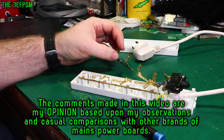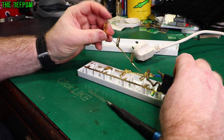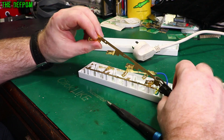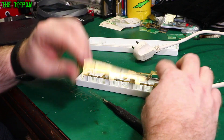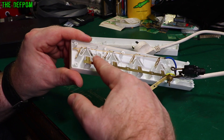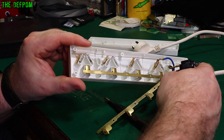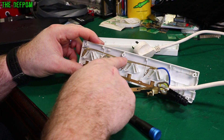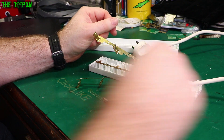If you had a nice positive connection like you do on the earth — the earth is really good — if they did that same connection for all of these it would have been absolutely fine. It's not a great design. Now, if you look at this one here — can you see these black dots? There. And there. And there. These have all been arcing. All of those connections have been arcing. There's another one there as well, on that side. Yes — these have been arcing. The fact there's evidence of arcing pretty much proves that the design's not that good.